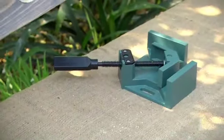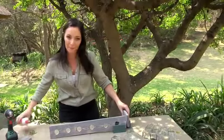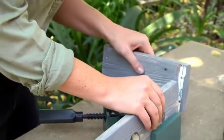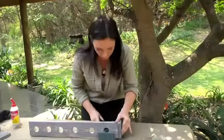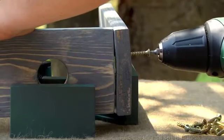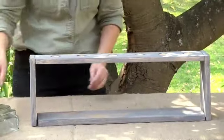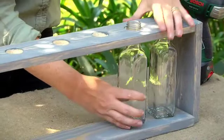I'm so impressed with the stain — it looks amazing. Now it's time for assembly. To assemble the top part I'm going to use a corner clamp — it's really easy and holds everything in place. Before clamping, I'm going to use some wood glue for extra security. Once placed inside the clamp, you turn the knob to secure everything so your hands are free while you're drilling. Before securing the base, I've left enough space for the bottles to be placed in permanently, so I have to be very careful placing them in and then driving the screws at the bottom.